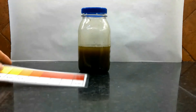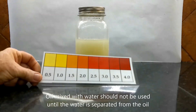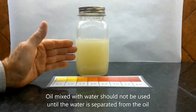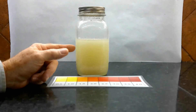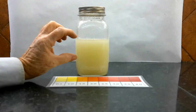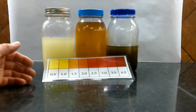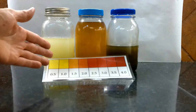Because this exceeds 4.0, this oil should not be used and should be recycled. Now you may have oil that does not look amber or does not match the scale. When oil is milky like this, that is a sign of water that has been mixed with your oil. In cases like this, take the oil and let it sit for several days. There's a good chance that oil mixed with water will eventually separate — you'll have good oil on top and water on the bottom. If that's the case, pour off the good oil and leave the water behind. Other than having your oil professionally tested, which can be quite expensive, this is about the only way you can gauge the quality of your oil yourself.